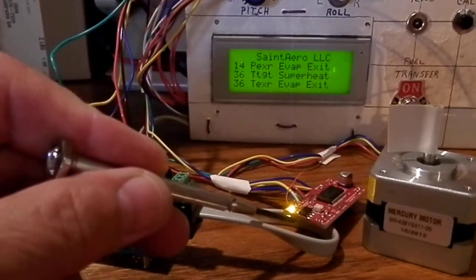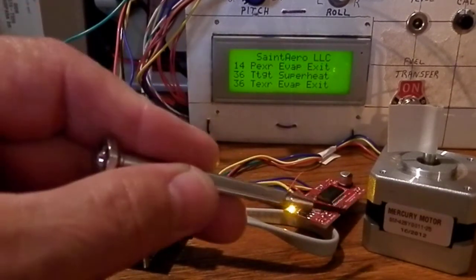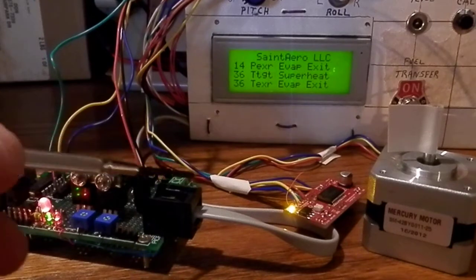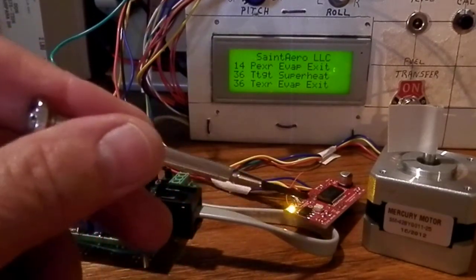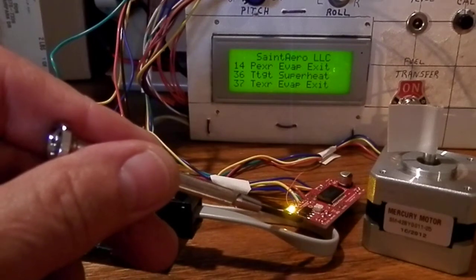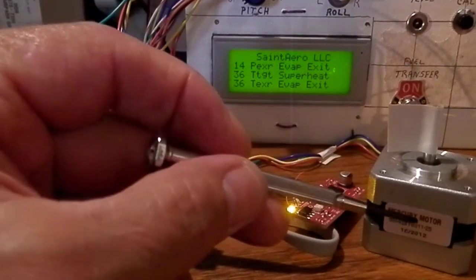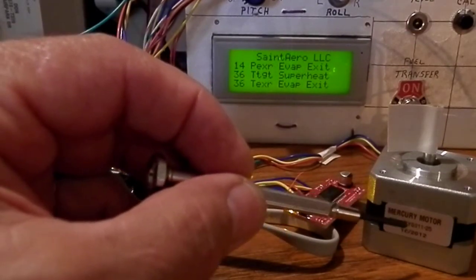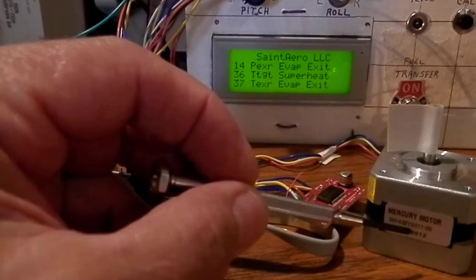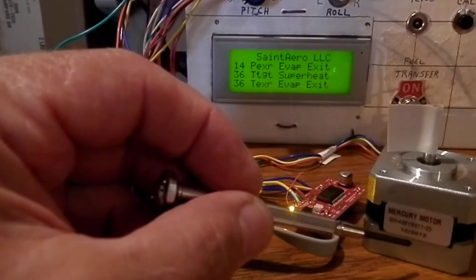The board here is used to drive the stepper motor based on commands from the PIC microcontroller. It implements micro steps and is set up for one-eighth increment steps. The motor is a 12 volt DC two-phase stepper motor, similar to what you'd find in electronic expansion valve control.